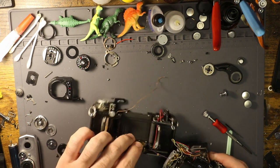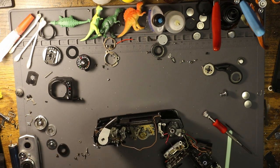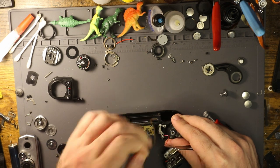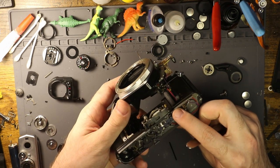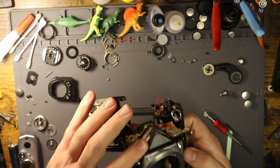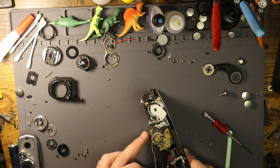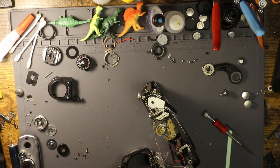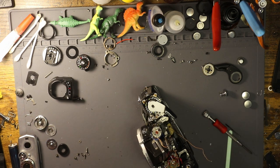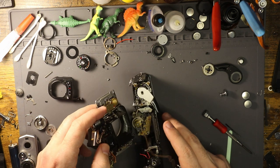I'm really not stoked about this because I just don't really like working on these. If you do want to fire the camera manually without the mirror box attached, you advance as you would normally, then hold the bottom up like this and just press on that — that should open up the lever. I might make another video about that in the future. It is really easy, it's just kind of a pain once you get it to this stage. Margin for error is very slim.